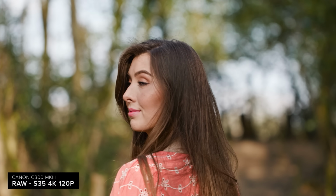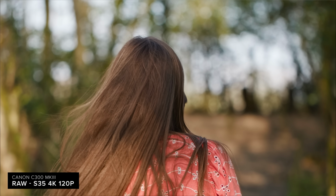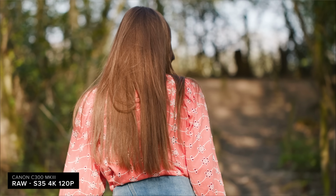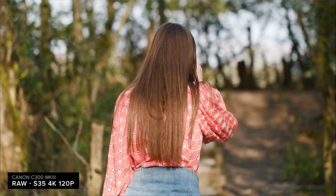The first path contains the regular, highly amplified signal. The second path contains a signal with lower amplification to capture the information that is clipped in the first path. Both paths feed into the camera's AD converters, delivering a 14-bit image for each path. These images are then combined into a single 16-bit high dynamic range image.